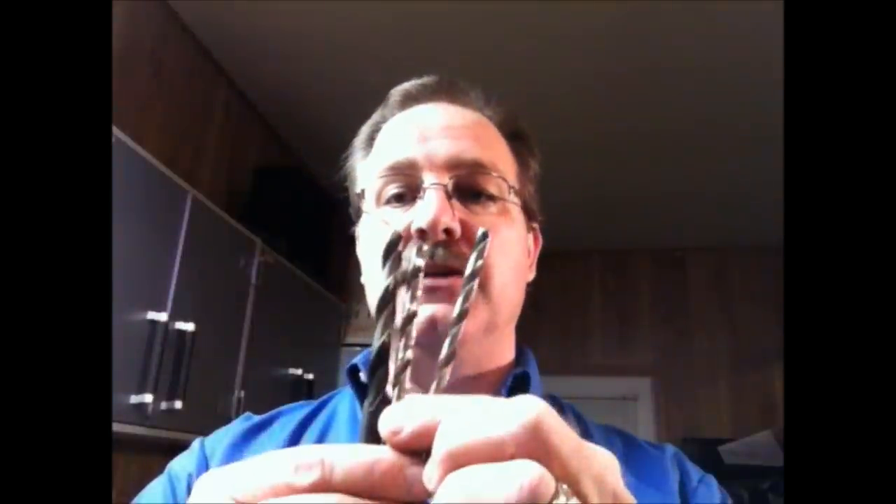The real workhorse is your drill bits. When you buy online or from a catalog, they'll tell you right next to the pen kit what size you need — a seven millimeter, eight millimeter, or whatever. I highly recommend buying the best bit you can afford. It's not a huge expense — five to ten bucks is the average cost per bit — and you'll use them hundreds of times in a drill press, on your lathe, or in a handheld drill. Don't skimp on the bits.